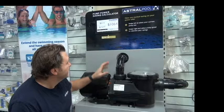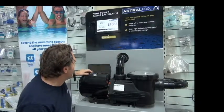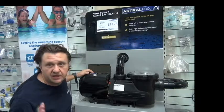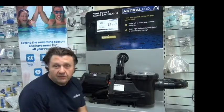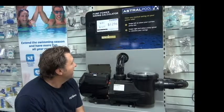All the pumps are going to be the same — don't get too caught up in star ratings because we need to fine tune it. This is at 1800 RPM and there's a reason I've set it at that. We can reduce the speed and obviously as we reduce the speed the savings are going to increase quite dramatically. However, when you're setting up the full system there are certain limitations on how fast you run your pump. We'll go and demonstrate that now on site.